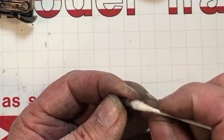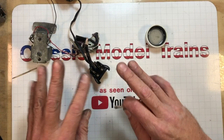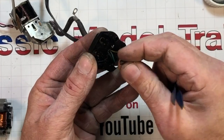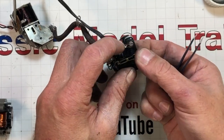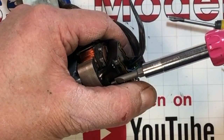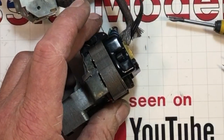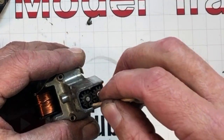Clean your brushes too — since this one was contaminated by petroleum, a little bit of odorless mineral spirits to get that oil off. Then clean the armature. If you clean the commutator, you also have to clean your brushes if you want everything to work as it should. These brushes have a little line down the end of them, and those have to line up with the brush spring inside. Once you get them in, get them rotated so the brush spring and the line are all lined up. Put these little fellers back on. This is Bakelite — it's good, but it's brittle — just a light snugging.